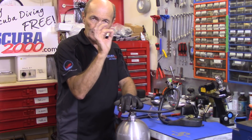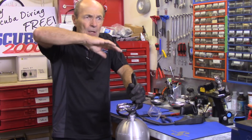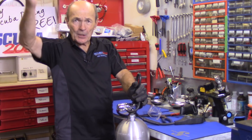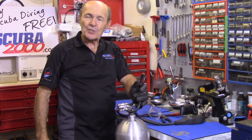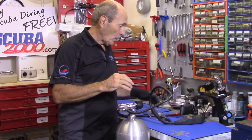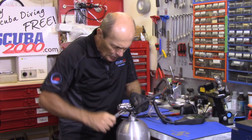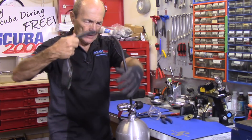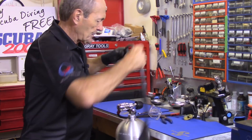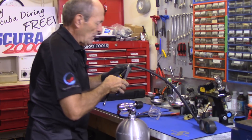There was a loud bang, which I expected. The reason for the bang is simple — this is a rubber hose that expands a little bit when high pressure air goes in. When you turn on your tank valve, the hoses move a little bit because they expand with the pressure. If you have air in a rubber hose expanded — picture a balloon — and you prick it, you get that pop. But why wasn't there a massive rush of 3,000 psi air? Why didn't the diver get blown over? There's a reason for that. I'm going to take this high pressure hose off and show you.